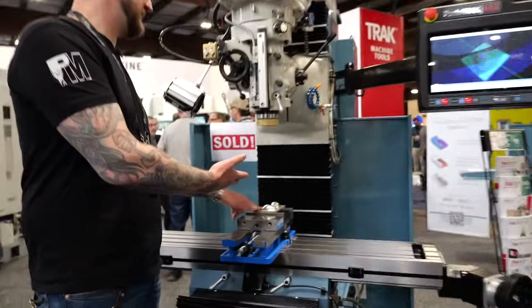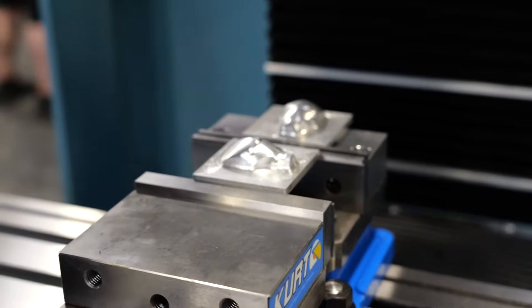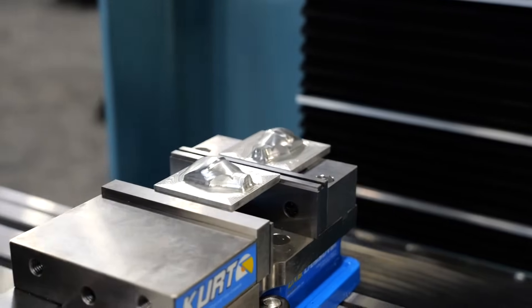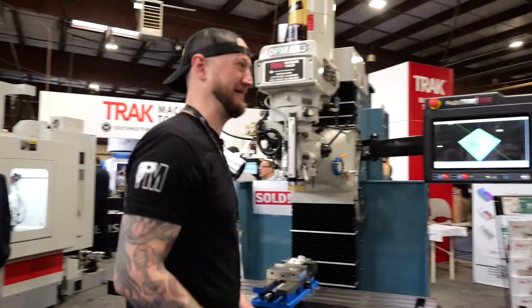You guys not only do full three-axis, but you can do 3D machining on a machine like this. That's where you'd send over the G-code file right to the control and do your 3D surfacing. But then take that part out and run it just like a manual machine — if you need to pop a couple of holes in the back, away you go.